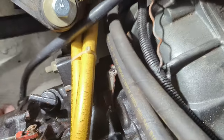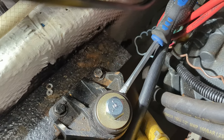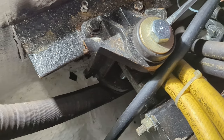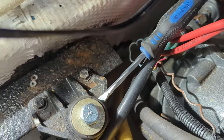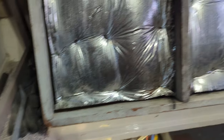Mid-project update for the engine mount bolts. It was a pain in the butt to get that bushing back in the slot — I tried with the top first and the bottom wasn't aligning. So I resorted to the hammer — have a big hammer. Between a few hammers and some prying, I finally got that rubber bushing to sit down in the hole. Tightened it up and we should be good to start adjusting the engine now that the mount is not broken in half.